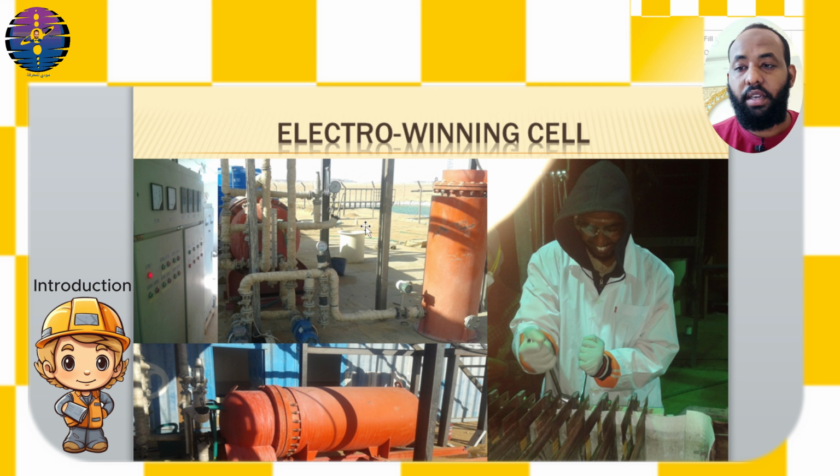Electro-winning cell. This stage involves using an electro-winning cell to precipitate the gold from the gold pregnant solution by applying an electric current, causing gold to deposit onto the cathode. Electro-winning cell details: electric current ranges between 150 to 300 amperes with a voltage of 2.5 to 3.5 volts. The solution used, the gold pregnant alkaline, is continuously circulated.